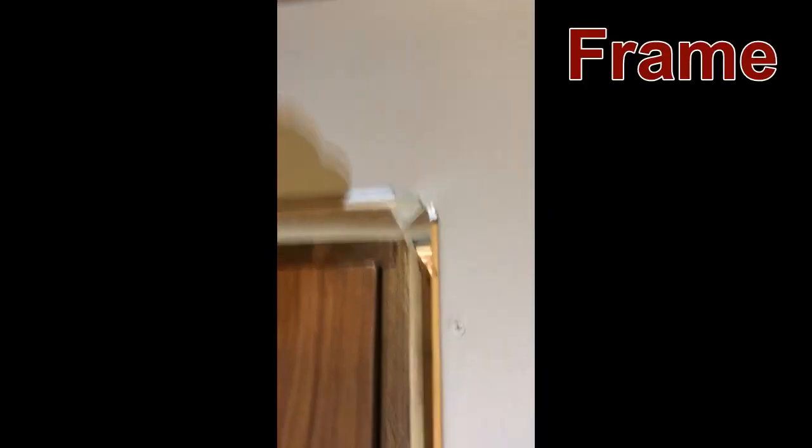Now, here we are on the inside, and we can say the inside looks great, but as you can see, our reveal at the top of the door is that we have a normal reveal on the hinge side. However, whenever we come over to the other side, we're tight. So we can see that the floor is out of level, and we need to actually shim this side of the door up. So we will be doing that. Now, I will be able to take my time and shim down along this side of the door and pull this frame over to where we have a nice gap in between the frame and the door. At the same time that I do that, I will also be checking and seeing how the door is working with the edge hitting the stop. And if I need to, I will adjust that accordingly as well. So that's our next tip.